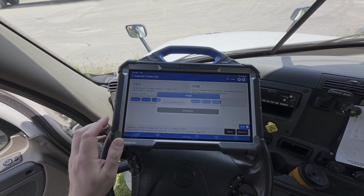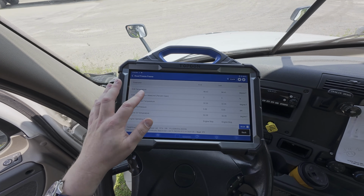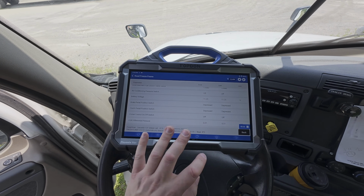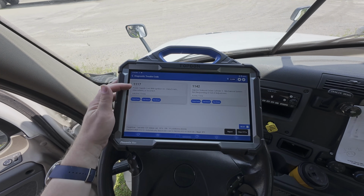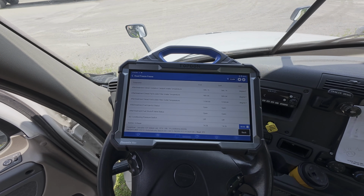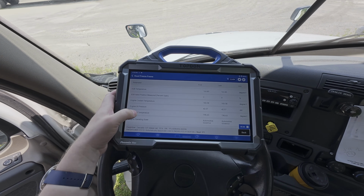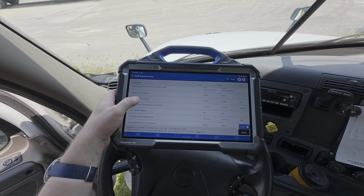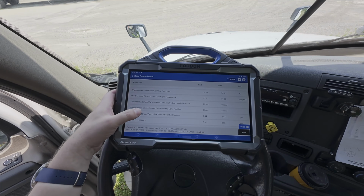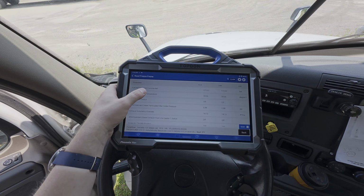Now, we may also have freeze frame data for these. And of course, sometimes the freeze frame data may be very useful. You can see right there was a low voltage condition. 11.25 volts is pretty low. And that fault was related to power supply. You can see what we have for freeze frame data here on the injector solenoid. Now, sometimes, again, this may be useful information. Other situations, it may not provide much insight. So it looks like in this case, there's a pretty wide variety of information that is stored specifically here in the freeze frame data for this vehicle.